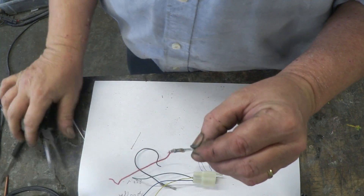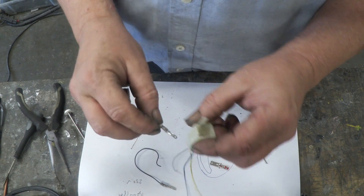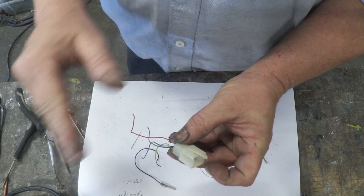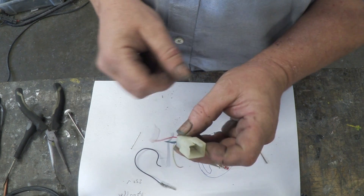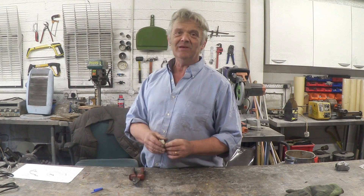Once that spring's loose, the whole thing will pull out. When we've got it pulled out and the spring is in good condition — which it is if you just press it — then you can put it in the right place where it belongs. You push it back in, the spring will snap out, and you will have wired one of those correctly. I've used nails, pins and pliers to do that job. It's a little fiddly, but it's no more fiddly than cutting the whole lot off and re-soldering it. And of course you get the case really nice and the whole thing goes back together very well.